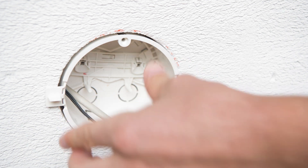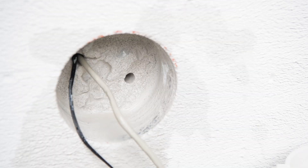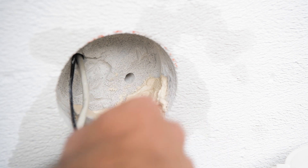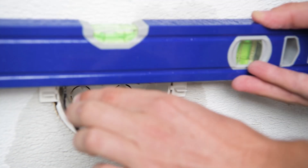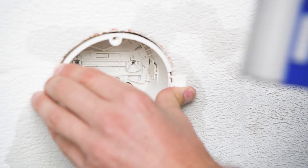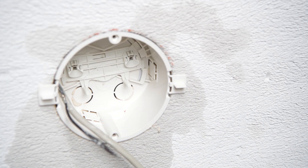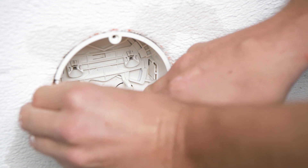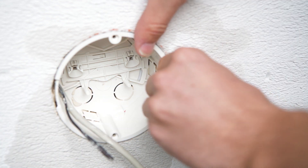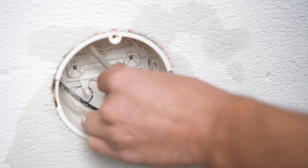Test if the box fits the hole. If it does then you can fix the box in place. Make sure it's level and not tilted vertically. After seating the unit in mortar we recommend waiting for at least two hours for the mortar to harden. Then you can break off the clips, tidy up the cabling and fit the dust cover.